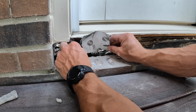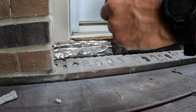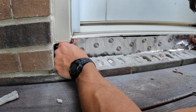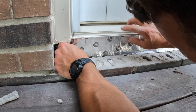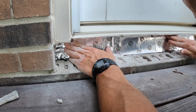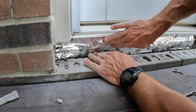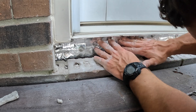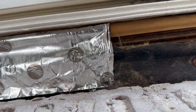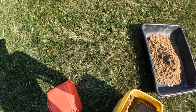That's a Pella brand flashing tape and it was really nice, sticky stuff. There was some roofing paper or tar paper behind the brick that was in fairly good shape, but I ripped off a couple pieces of flashing tape and repaired the spots that were damaged. Then I put a nice big layer underneath the subfloor and wood flooring to seal everything and overlap onto the roofing paper. So if water gets behind the new sill, it'll hit the flashing tape, dribble onto the roofing paper, and then have a spot to dry.